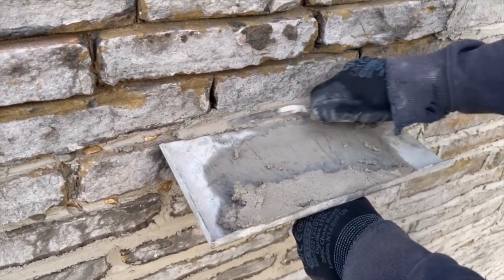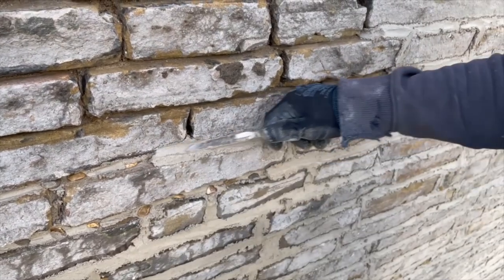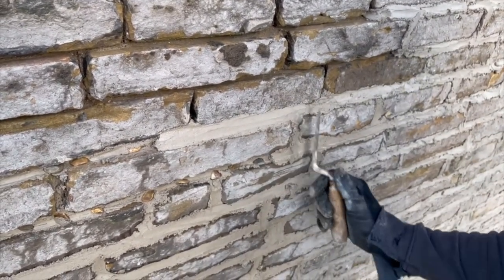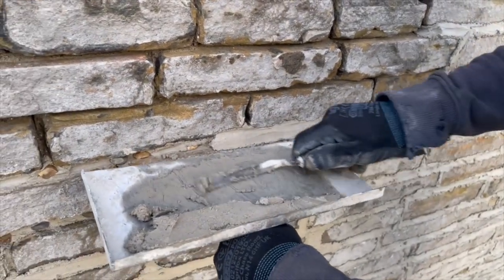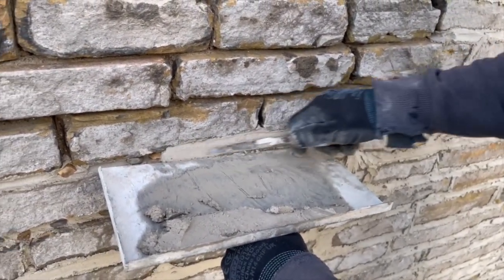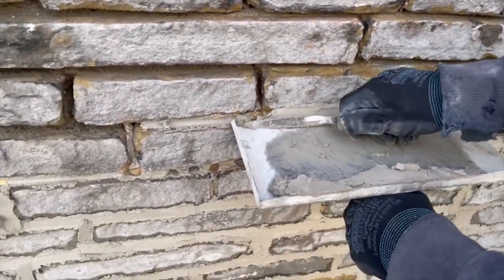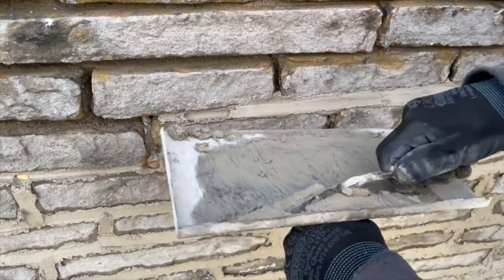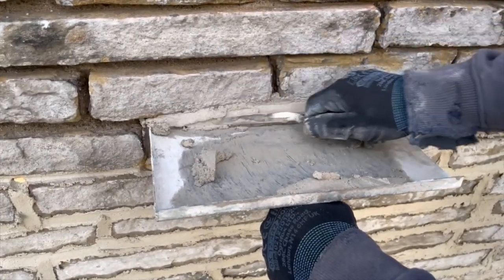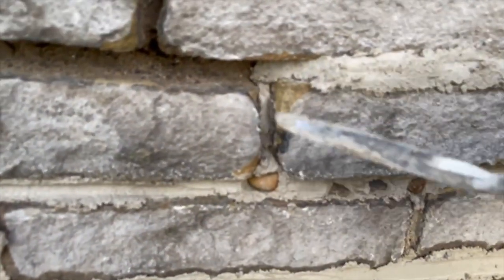We try to keep it fairly tidy, but we're not going for the finished texture to the mortar at this point. The more we work it, the more fat is brought to the surface of the mortar. The fat is basically your fine aggregates and your lime. If we were to leave the fat un-raked back on the surface of the pointing, we get cracks forming and water ingress, because there's no solid sharp aggregate binding the mortar together. I'm keeping it slightly proud of the harrises, and when we get to the end of a section we work it back so we've got a nice tight joint there ready to join onto the next section.